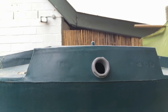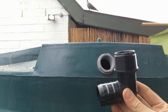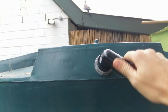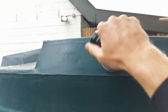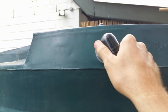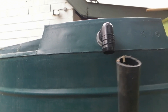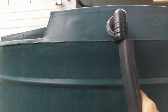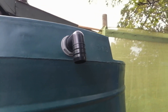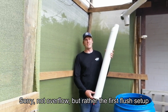Exactly the same principle applies with the overflow valve at the top. There's a plug in there — pull that out and then take your L-bracket and turn it in. This one doesn't need to be as tight; there's no pressure on it, it's merely an overflow. Get it pointing down nice and solid, then take the piping you need and fit it onto the connector, put it straight down, connect it to the L-bracket at the bottom, and leave the excess pipe running out into the garden.